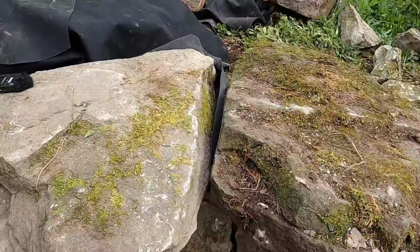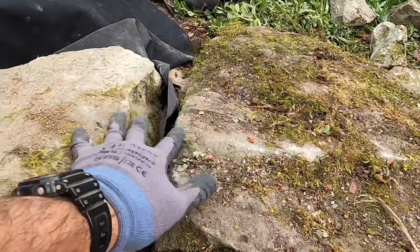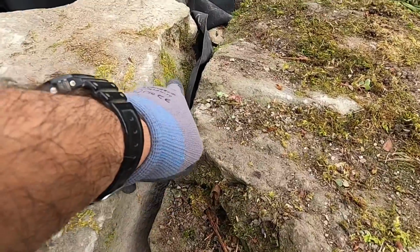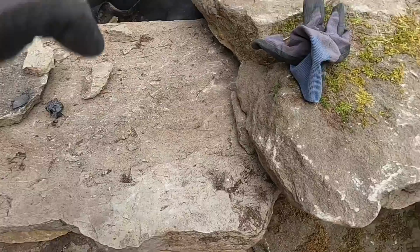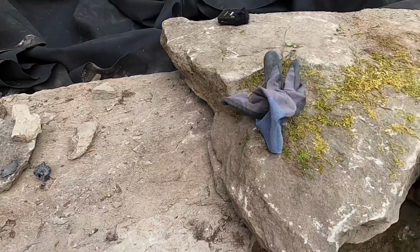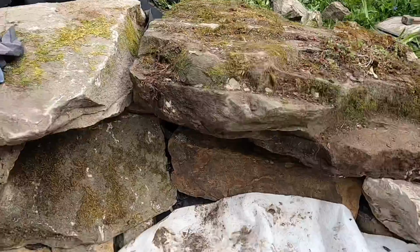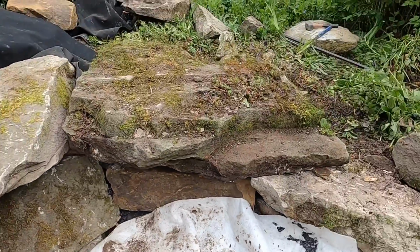And what's nice is that the cascade lining is going to fit between these two stones and tuck up and get concealed there nicely, which means that the cascade lining is significantly higher than the highest point of the water, which is the spill stone. So that ensures that nothing can leak. Now this needs a bit of wedging and propping up underneath, foaming into place.